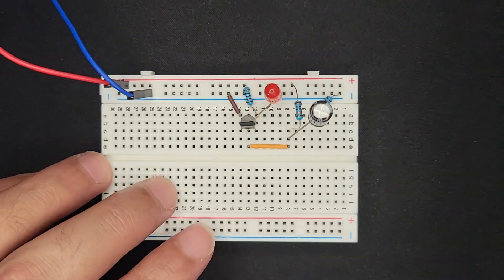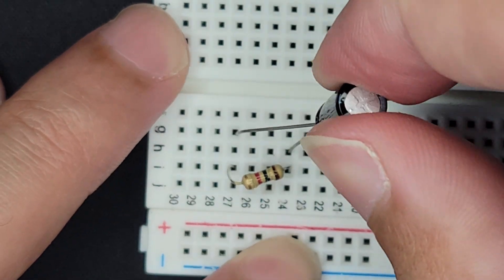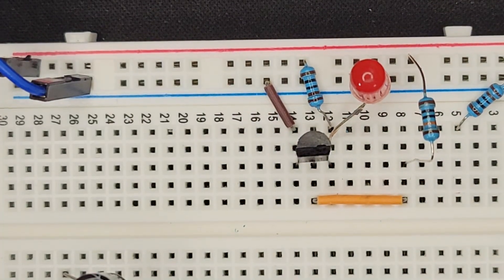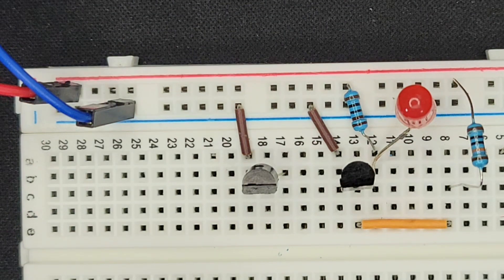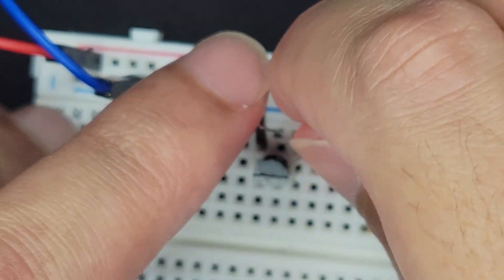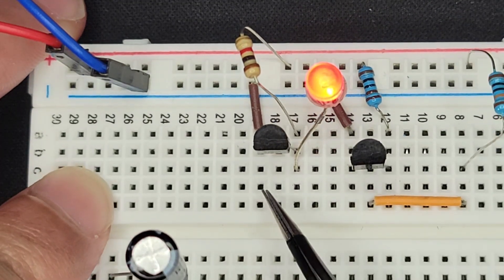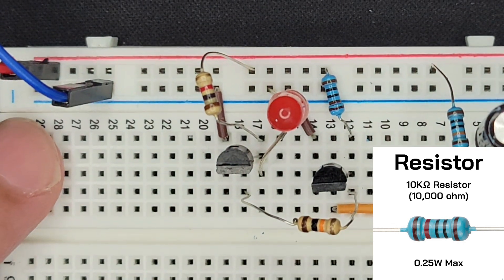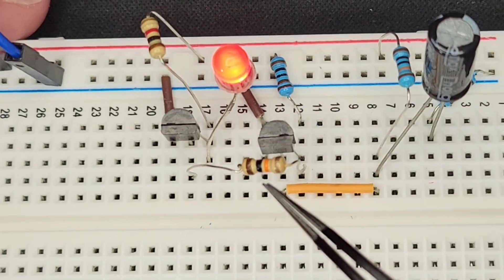We need to do two things: add the inverter and discharge our capacitor. To discharge, I'm going to add another 1000 ohm resistor and plug the capacitor into it so it can short against itself and burn off the voltage. An inverter pretty much just has a transistor that is grounded, then we add a power source to it — maybe a 1K — so our LED can be nice and bright. We put the LED in parallel with this transistor. We can see the LED is on by default until we activate the base. We take the signal from the collector to this base with about a 10K. Putting our capacitor back in, it's off by default. Now the capacitor is charging and the LED should turn on when the capacitor reaches a voltage that turns on the base — and there it is.